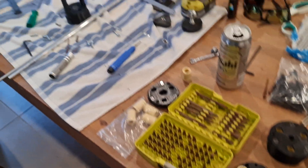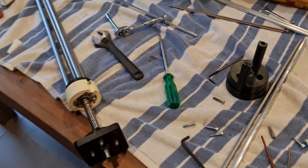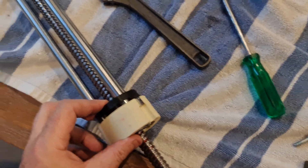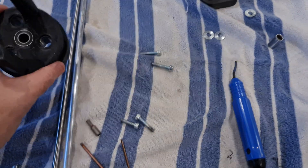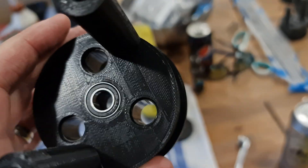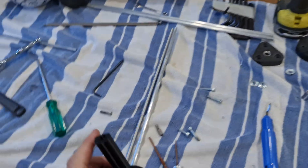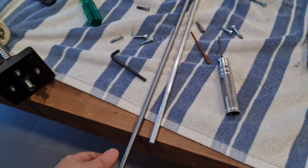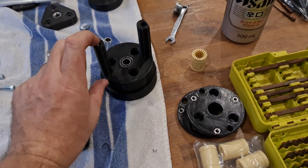Quick update — pulling the actuators apart again for hopefully the final iteration. A couple of little things I'm doing, mainly because of the squeak. I think it's these igus bushes here, but it could also be the fact that I had a 100mm bolt coming all the way through to pick up the tube. What I've got now are tubes cut to length to get rid of that.